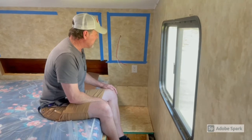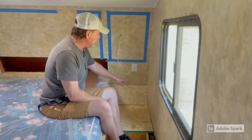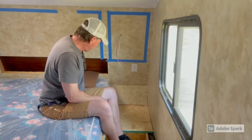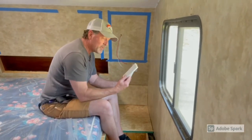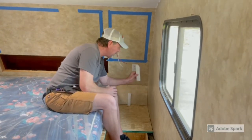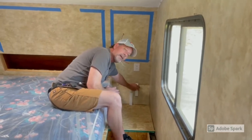Today we're building some cabinets for the bedroom — the nightstand cabinets. I took my square in earlier and drew some lines to determine what the angles are. I cut a couple of scrap pieces just to test them. This one's a 22-degree angle — that fits in there perfectly. That one's a 45 — fits in there nice and snug. So now I have my two angles.